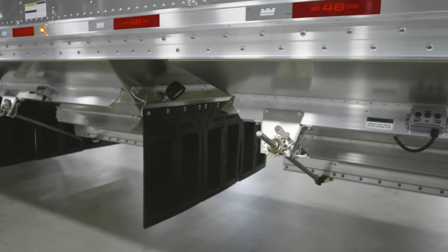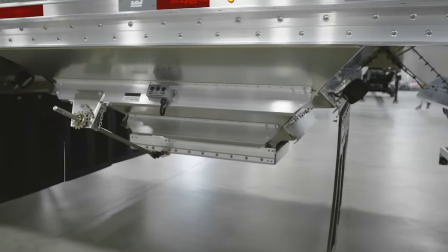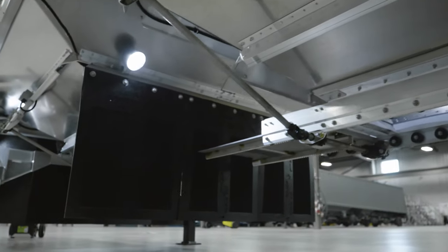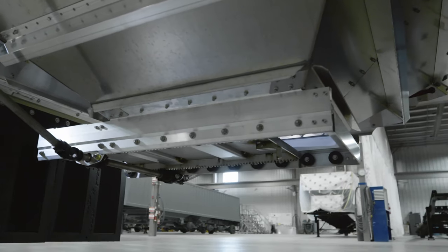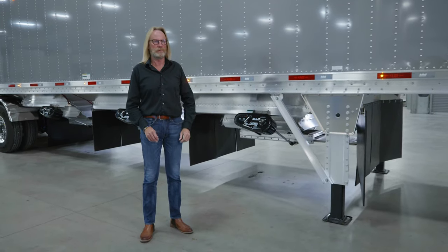The three hoppers also have a nice high clearance for swing augers — well over 21 inches minimum depending on tire size, giving you lots of room to swing the auger underneath when moving from hopper to hopper. The chute frames are the same as used in all of our trailers. In addition to the rack and pinion design, the gate itself is made out of stainless steel, which is especially important in this trailer because fertilizer is often being used. The stainless steel will not rust and keeps any debris from coming into your hopper. As the chute frame rolls out, the gate is supported on nylon rollers with replaceable Teflon wear strips — as the trailer ages, you can refurbish the gates with new Teflon wear strips. Underneath the kingpin area there is a full closeout to keep debris from coming up into the hopper area, and there is an accessible manhole in that area should you need to get in for any inspection.